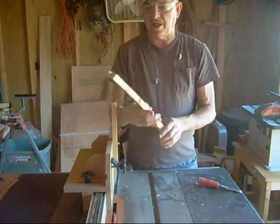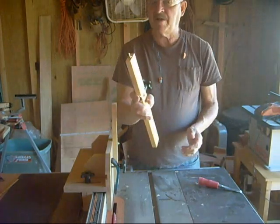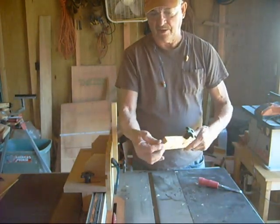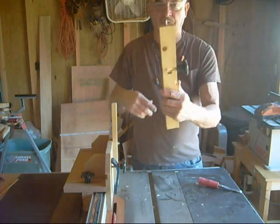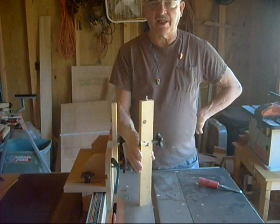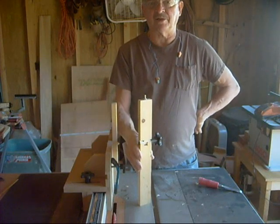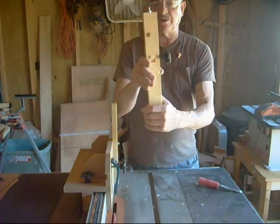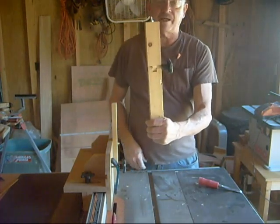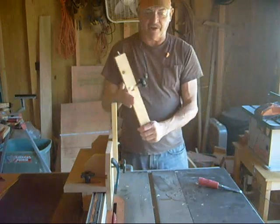That's just a quick project, something that I needed, so I made it. And the end here, I just got a 1/4-20 hanger bolt with a nut that holds that tight. Camera screws right on a 1/4-20. Now, if any of you guys out there want to take videos and you got any kind of tripod, you could build a tripod. Just clamp something on a workbench to clamp a board upright, screw this into your camera, you've got a tripod. All there is to it.